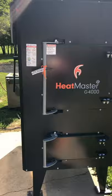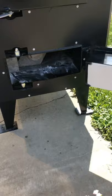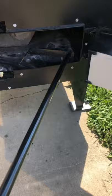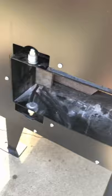All the cleaning can be done from the front — no need for an air door to maintain and keep sealed. There's the ash rake to get behind the refractor. You come up, put the ash rake inside, and drag everything right out.